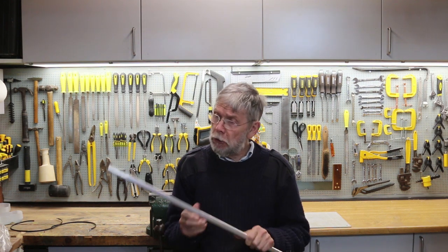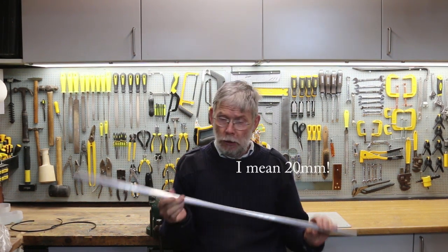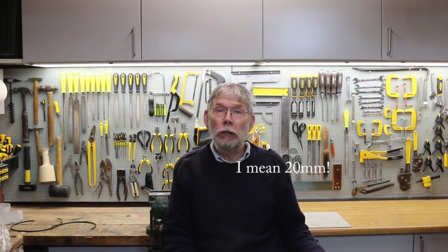So how about the dogs? Well, for that I should be using this: 10mm aluminium bar. This is a metre length and should cost you around £17 in the UK. If you cut it into 60mm lengths, then you get dogs for around £1 each — that's not bad. So let's be doing it.